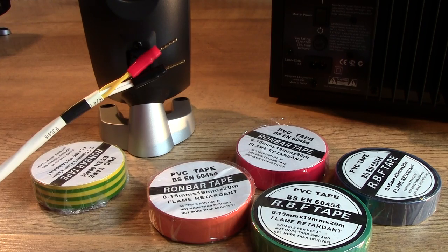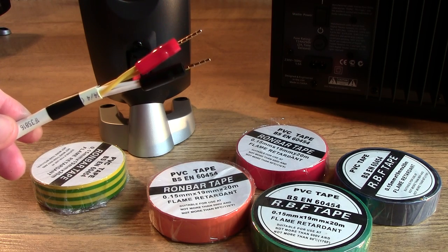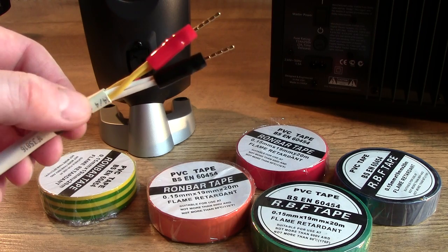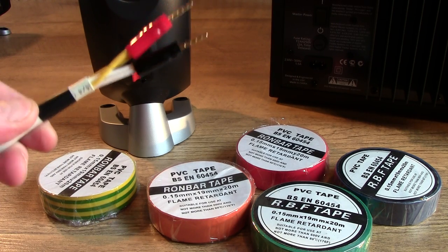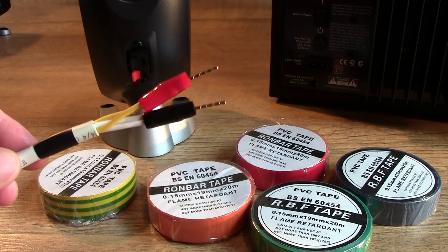It's just very easy to put the wire in and take the wire out again. A very simple solution that allows me to use the much thicker gauge wire - remember, we're using 12 gauge wire, high quality wire, compared to the 18 gauge cheapo stuff I was using before. Another thing I like to do with surround sound cable is make it obvious which cable is for which speaker. I do this very, very simply by putting electric tape of different colours around each of the cables, at both ends - both at the amplifier end and at the speaker end. That way, at a glance, you can immediately identify which speaker cable is for which speaker.